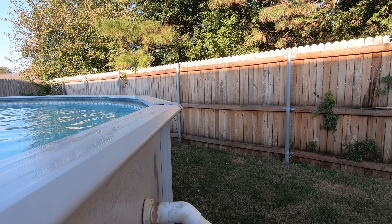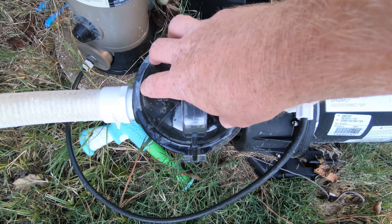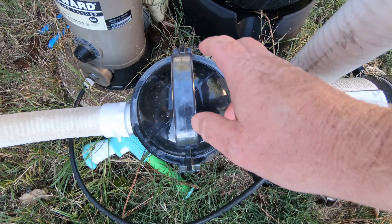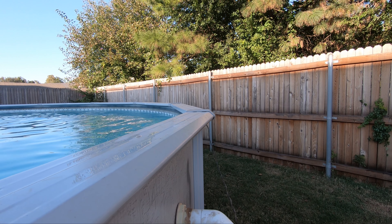Make sure the water is below the skimmer and completely out of all the lines. Turn the lines upside down, open any areas where water can drain, and let it dry out. If you have to leave equipment outside, be sure it's 100% dry and cover it if you can. I like to take my pump inside because this plastic part can get water and ice on it in the winter, and it can crack — you don't want to crack the lid or this plastic housing during the winter. Best just to take it inside.